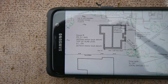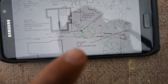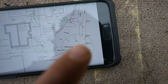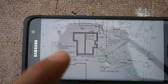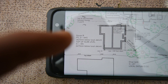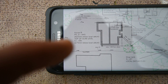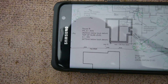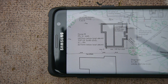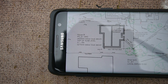I don't actually have it printed out yet — I've got it on my phone. You can see here — that number there, the datum line says drop curb 51.87, local datum 00. So that has been reset from that to zero. That is the point we took from the drop curb outside. We had the camera set up just over here and I've put our datum around here. So the top of slab level will be — not the finished floor, because obviously the FFL — finish floor level — is above that. We need to take another peg 675 millimetres below the one we've just put in. That will give us the top of the slab level, which I will be able to work down from to determine how high the footings need to be filled with concrete.